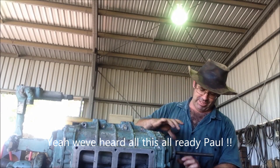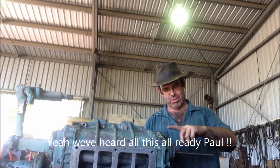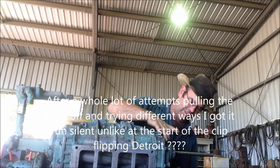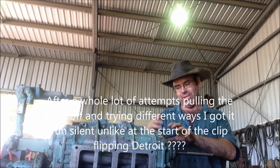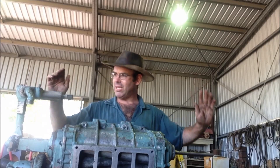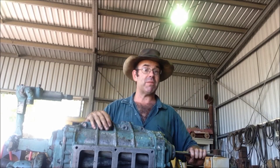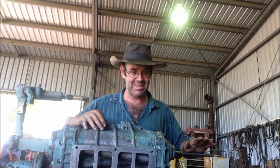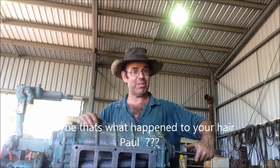The GM Detroit book doesn't cover this: the two gears on the end of the splines have notch keys — one spline missing — and they've both got to be pointing upwards when you're timing. Then the gears slide on and fit into those notch keys. Then you slide the shims in behind the top gear to get the spacings between the rotors right. Everything is working. I've had it on the electric drill, revved the bejeebus out of it — I can see the governor moves in and out. It spins and blows a powerful stream of air, or sucks, depending on which end it's facing.